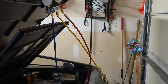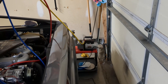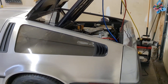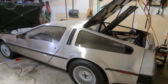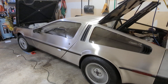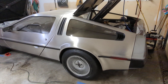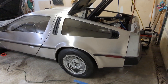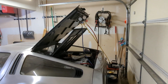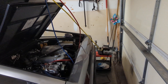If you did have a leak, the next step would be to hook up nitrogen and pressurize the system. You can hook it up at around 150 psi first and see if you can find something leaking - see if you can hear it hissing. I also have some big blue spray you can spray over fittings and things to see if it leaks. I'm going to experiment with the nitrogen once I get that other fitting, and I'll make a video about that too.